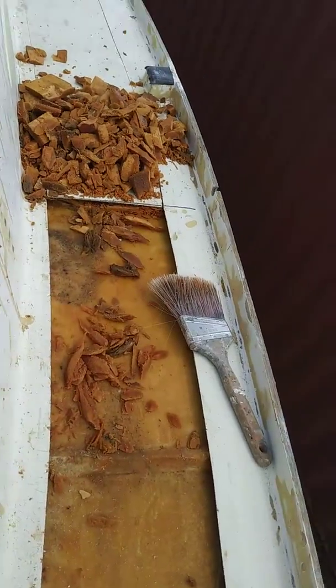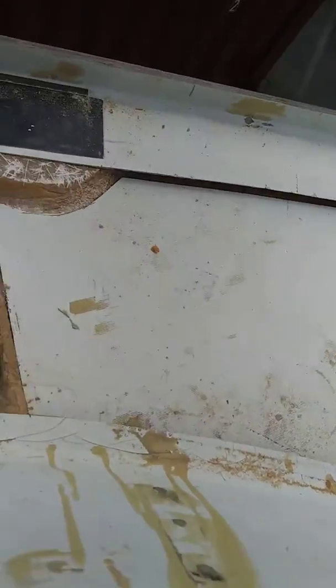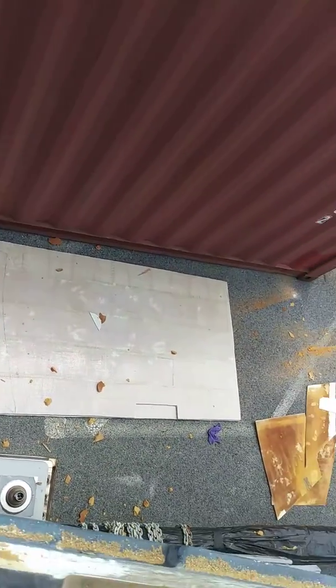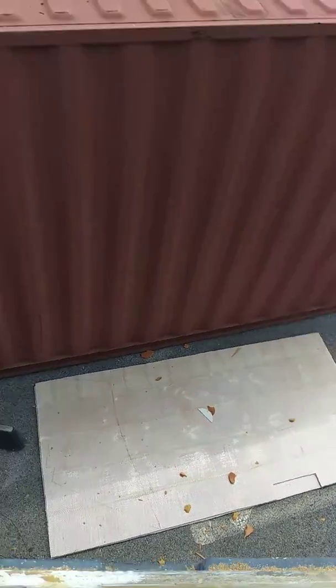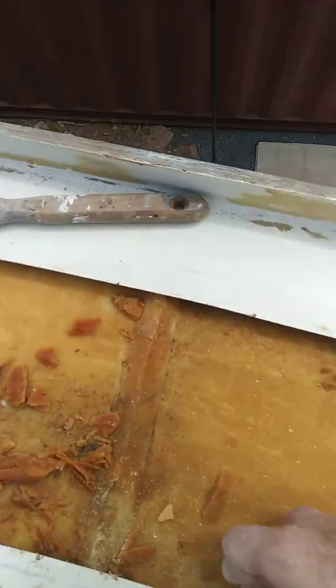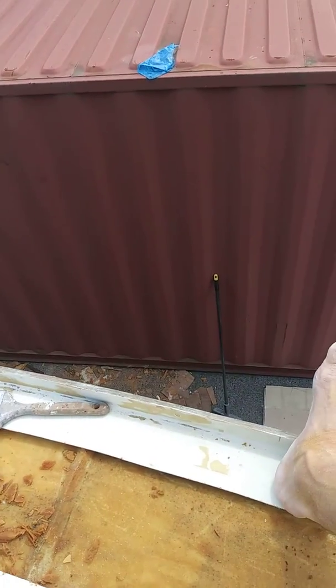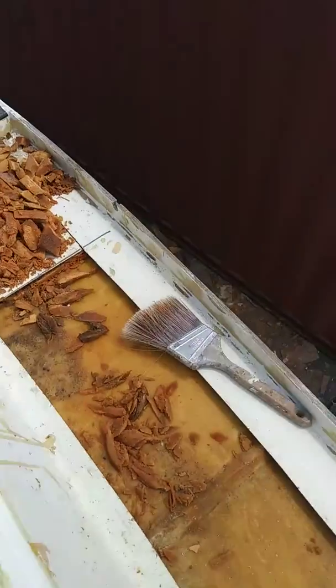Taking all that core up, I'm going to sand both sides of the original top shell down. I'm going to lay that on the bottom, adhere it to the bottom inside, and then down there I have the Pink Panther foam that's got a layer of 24-ounce glass over it already. So I'm going to cut that out to the shape, tuck it in underneath both sides, or at least partially underneath both sides, and we'll fill the rest with thickened epoxy.